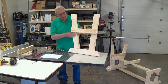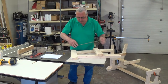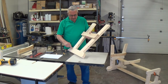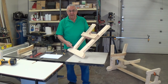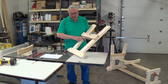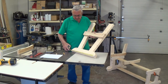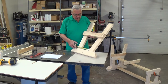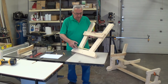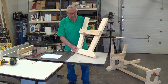On these legs, you'll see that one is on an angle and the other one is straight up and down. The measurement on the straight leg is 28 inches from the top to the very bottom of the base. This one here ends up being 29 inches from the long corner down with a 15-degree angle in this area. It's very critical that you get that angle right and get these in the right position on the base. In this particular base you want to find dead center, which is 22 inches, so dead center would be at 11. Your distance between the two legs is 7 inches, so you'd go 3.5 inches on each side of the center, and that's where the inside of these legs would be positioned. Very critical that you get that in the right location.